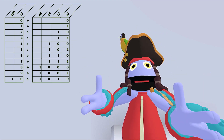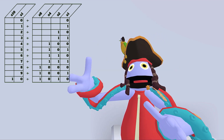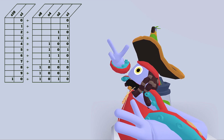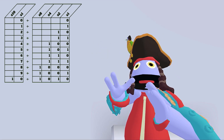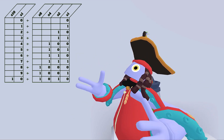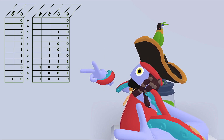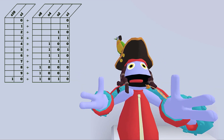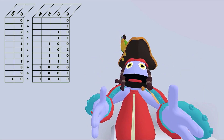Positional notation just means it increases just like it does in decimal if you look at the column there — the ones column, the tens column, the hundreds — you're used to that from school. It's the same thing with binary: first column is the ones, then the twos, then the fours, then the eights, and it increases by two each time after that. A zero all the way across is still zero. You have a one — that's as high as you can count in that first column without positional notation, which means when you get to the last number you can count to, you jump to the next column. When we go to two, we jump to the next column. We can represent three with two digits, and then we have to jump to the next column for four. That's how binary works. Hopefully that's good enough for you — if not, please go look for some other resources.